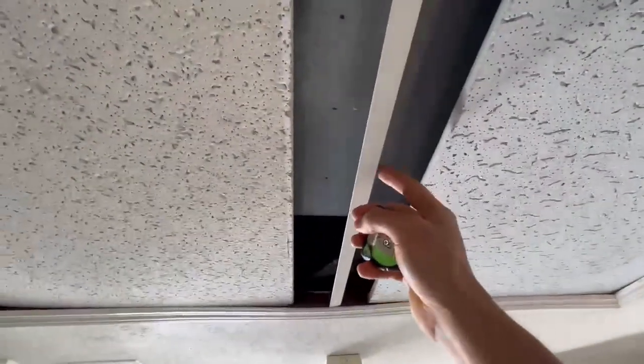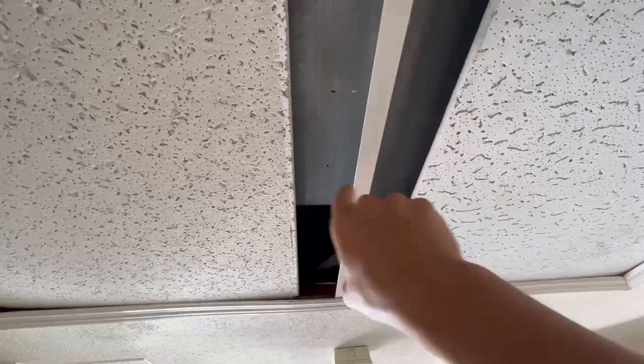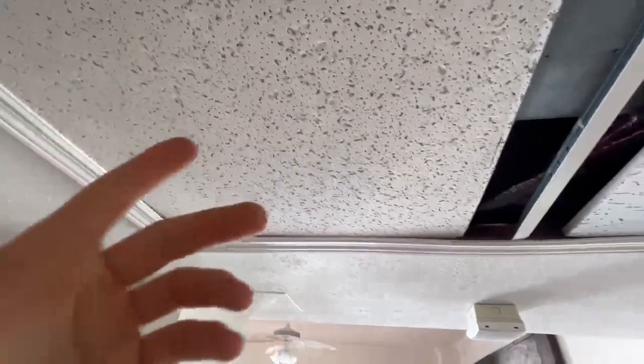They have three pieces in this one. I took this piece out and I've got these two up here. This is about a six and a half inch gap. What I'm going to do is add about three inches on each side of paneling — so one and a half on each side to make it even. Then that additional quarter inch will go here and a quarter inch there to equal another half inch, totaling six and a half inches. One and a half times two is three; multiply that by both sides, which is six, plus the other half inch.